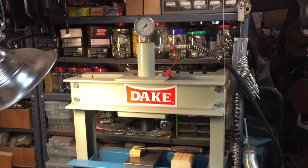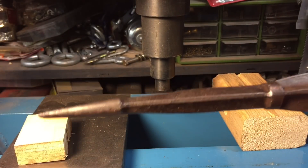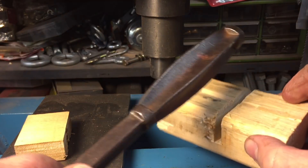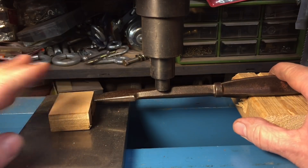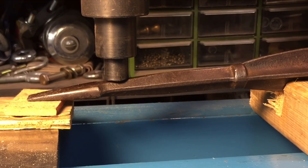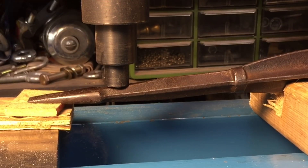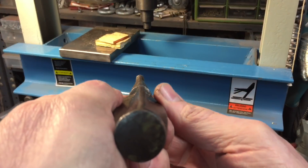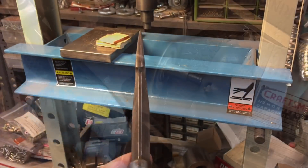Here we are at everybody's favorite — the Dake. Let's take a look at the setup. You can see how it's bent right here, and it looks like we have to push down right about here somewhere. So what we're going to do is I cut a notch in this piece of wood, because this handle is like this. We'll lay that handle in here, put it over here, and then press that down with a piece of wood under this set. Let's see what happens. That's going nice and easy. We've got to go a little bit past it. Raise it up and see what we got. That usually doesn't happen. Look at that — straight as an arrow, first time!